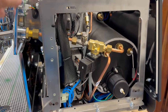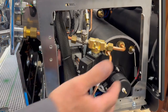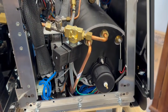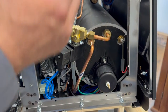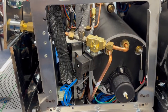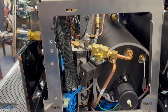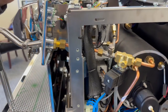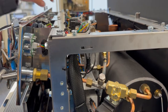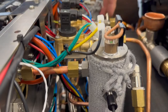One unique feature they've moved away from: there used to be a T3 system with heat exchangers in the steam boiler. Now the water comes in and goes through a loop inside of the drain box. Any discharge from coffees and expansion valves — which will be hot — preheats the water before it comes up and gets dispersed through the flow meters and into the brew boilers.